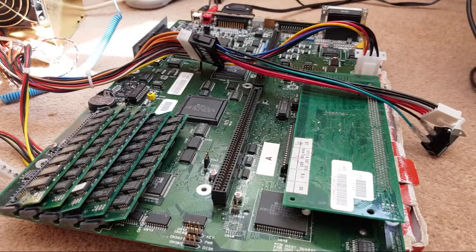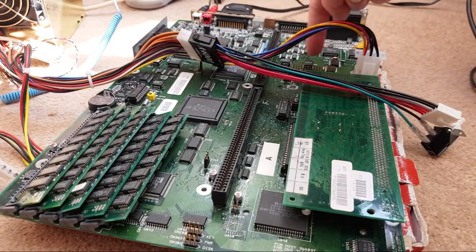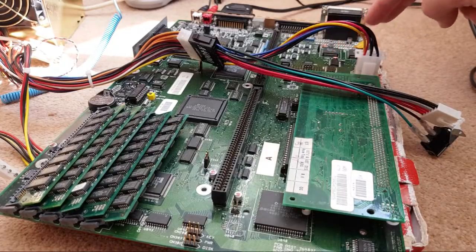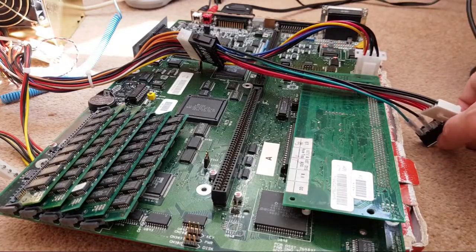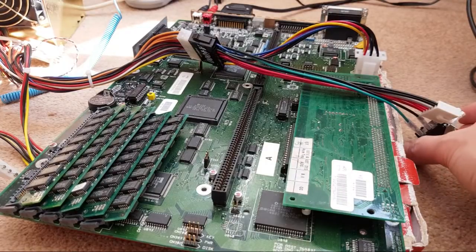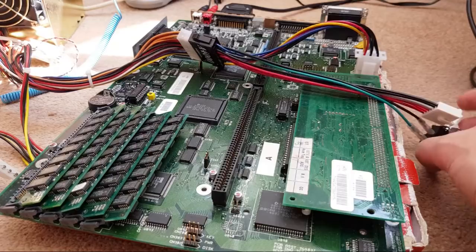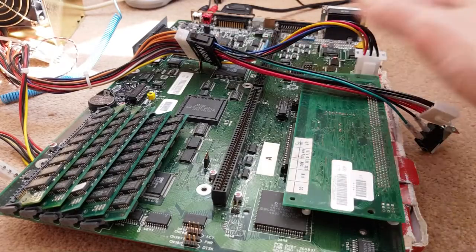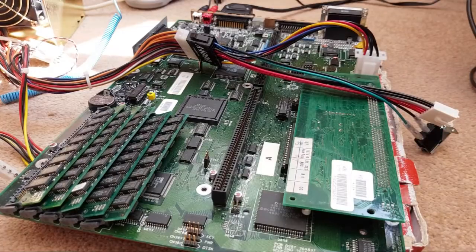And I got my freezer spray and I froze these here. Made no difference at all. I froze these two chips here, switched it back on, and IDE was working. And I know the chips are actually okay. And I haven't seen it since. And it's not been as warm as it was the other day. For one thing, I've not had the fire on, an extra 20 degrees like I did the other day, have I? So I think that's it. I think the IDE side on this board is now going to be 100% in terms of reliability. So anyway, let's hook up the drive and just make sure it's working.